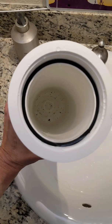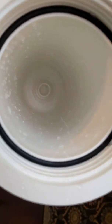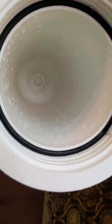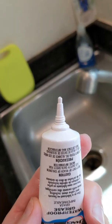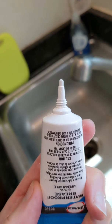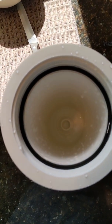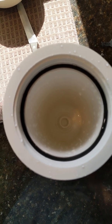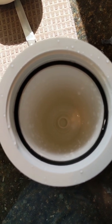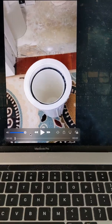Here's what the chamber looks like. I'm just going to rinse this out — I should probably use some soapy water but I'll just use my fingers to get the slime and grit out of there. We're going to cut the tip off of this grease tube and then run a bead around the o-ring, or gasket, and I'll probably use my finger to spread it.